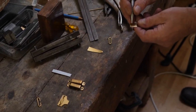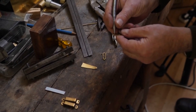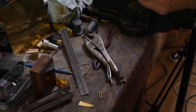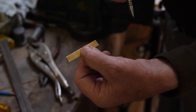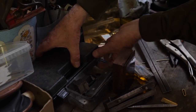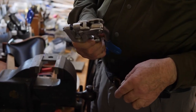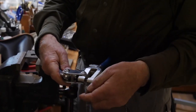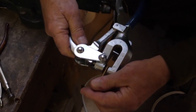You've got to make it stick there. Nope. See, it's got a sharper point on that end. So right. Now the next thing would be to put in the hole. If I'm making brass bellows, it would be these eighth-inch holes. If I'm making nickel silver ones, I'd use slightly smaller diameter holes because of the screws I use, that's all. Anyhow, you've got to get that punch to engage with that.